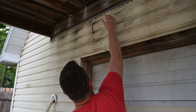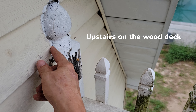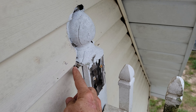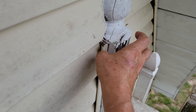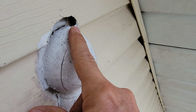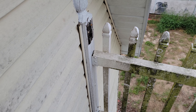You've got these open gaps right here where water is just pouring down inside the walls. And this is my personal favorite — I've never seen anything like this before. On this last baluster post they actually cut into the vinyl siding to put the post in. Why not just end it at the edge of the vinyl so you don't have to cut it? Now you're allowing water and egress into your house. I'm surprised this house could get any kind of insurance — it can't possibly pass any inspection.